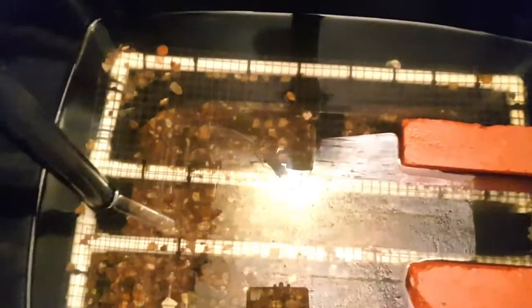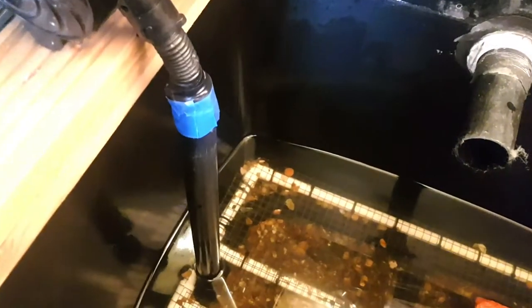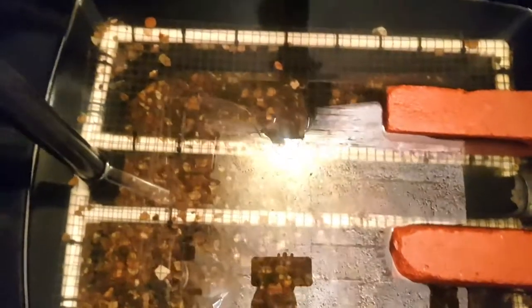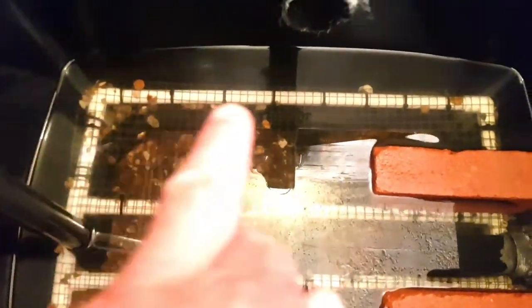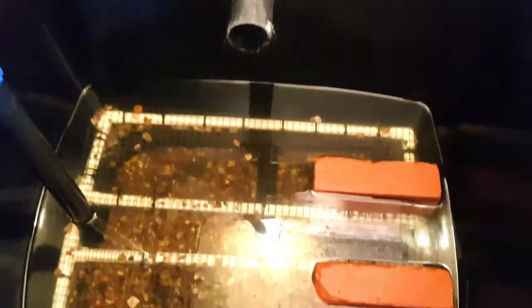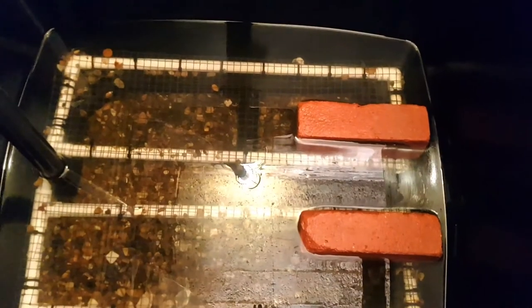What I normally do is take that inch and a half pipe there and blow air down that. That will flush all the muck and dirt from the bottom and push it out. Basically the pipe goes around the tank and it's got loads of holes in it, and that flushes out the water and all the debris.